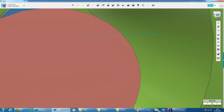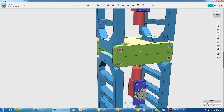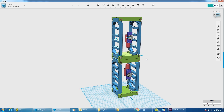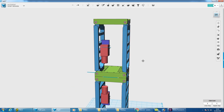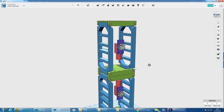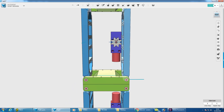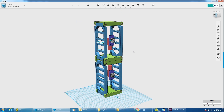There's an end stop right in the end of the shaft there, so that should be sufficient for running the stainless steel bars on. We need to get those sizings right, but I think that should be perfectly okay. Once we've got at least half of this assembled — just the top half today — we can start mounting the motor and getting that opposite gear the right size so it meshes properly. We also need a feedback pot which is going to go across one corner. We'll design that in once we've got this together. So let's print out some of these parts and see what they look like.